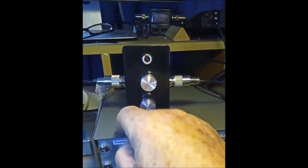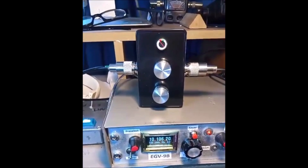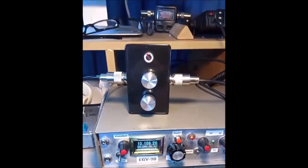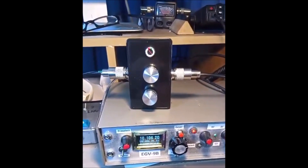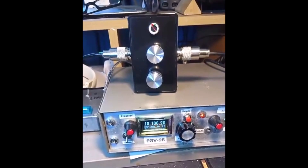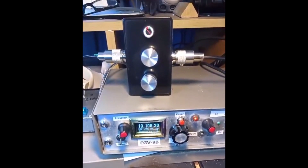Now the antenna is connected directly to the rig via the ATU, but the SWR bridge is not in circuit — it's bypassed. So that's the operation of the resistor bridge. As I say, it's not quantitative but it's relative, and it's a good tool to set SWR as low as possible. 73 from EI5 Echo India.